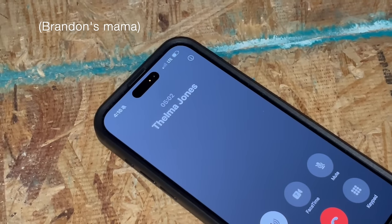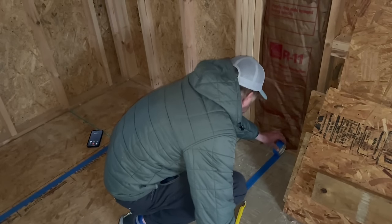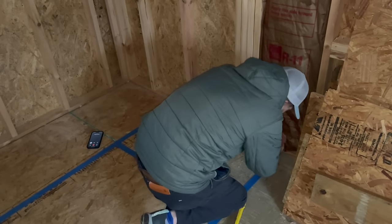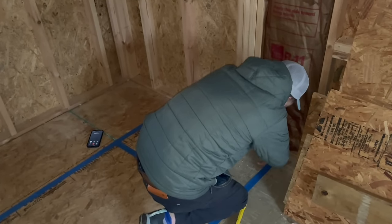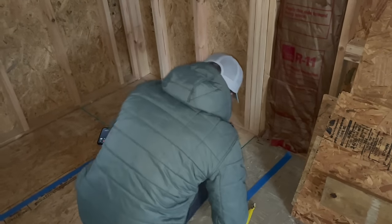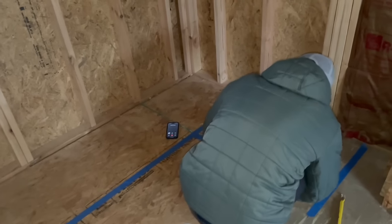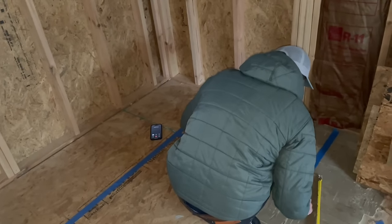44 inches off the front of that cabinet under the kitchen window. Come out into the room 44 inches. That's how much you need before you start that stove, so the stove door can open. You can still go by, you can still open your cabinet doors, and you've got a pathway. You see what I'm saying?